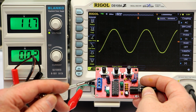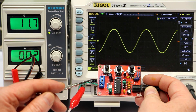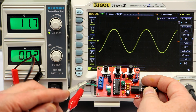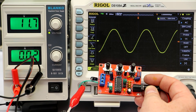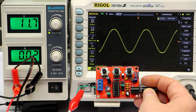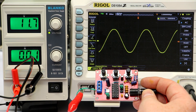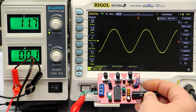This is quite easy to fix — just add an electrolytic capacitor at the output terminal of the sine or triangle output. The value can be anything between 10 and 100 microfarads; we'll discuss the difference later. Anyway, that is easy — you don't have to do any rework or resoldering or change of components. Just put an electrolytic cap at the output and you have an AC coupled signal.